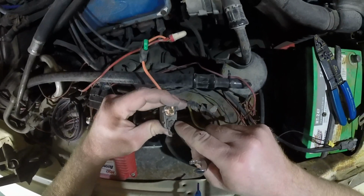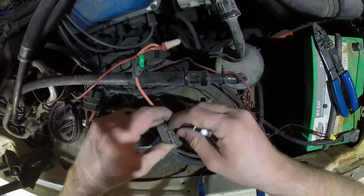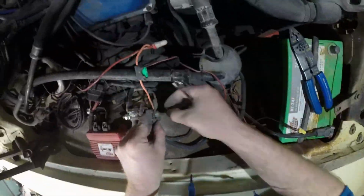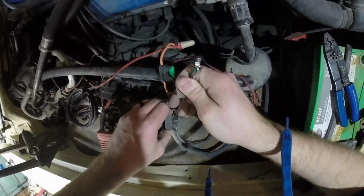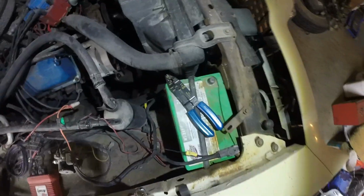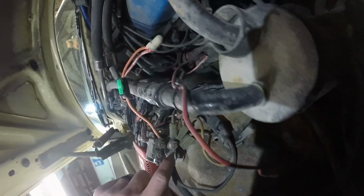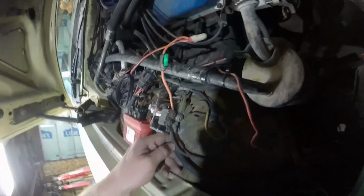Put it behind, because I want to make sure I don't have any wires touching the other end of this breaker. So that would kind of defeat the purpose of having a breaker. There, now the wires aren't coming out. Get this good and snug here. So I'm going to make sure there's no stray strands of wires touching anything that they shouldn't be touching. Which there isn't. They're all trapped in there, so that's good.